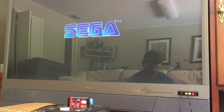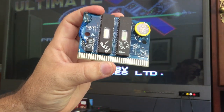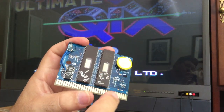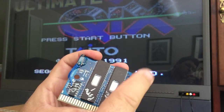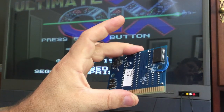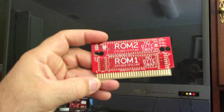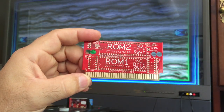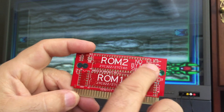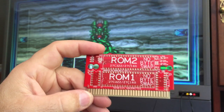That's about it in a nutshell. The ones that save are going to be produced soon, so they'll be available soon. Essentially all the parts come on the board except for the ROM. When you get the kit, you have to put a battery on, program your ROM, set a couple of jumpers, and you're done. All the parts on the back come pre-assembled and ready to go. The no-SRAM one — you just get a bare board. For a single game, you just need one or two capacitors and that's it. Set a couple jumpers and you're done.